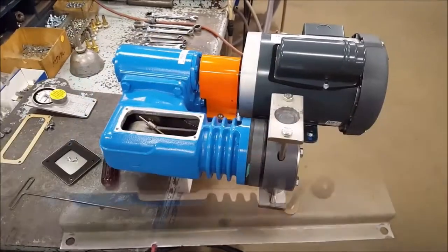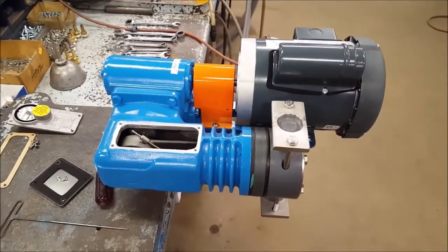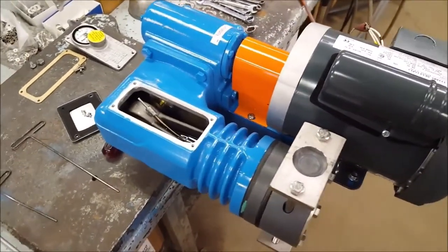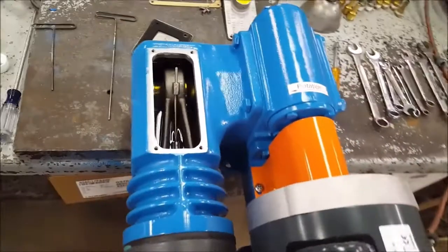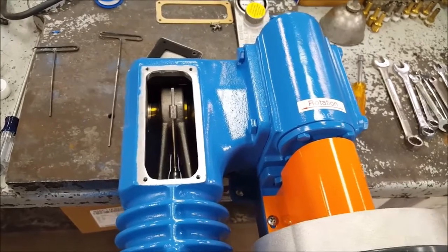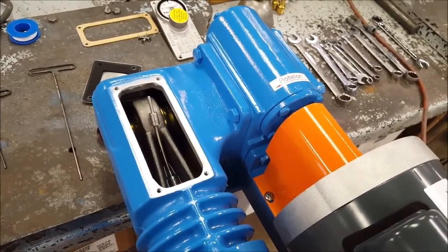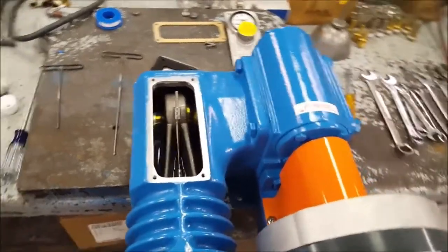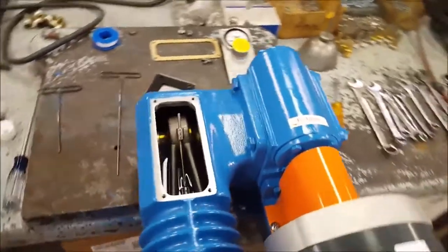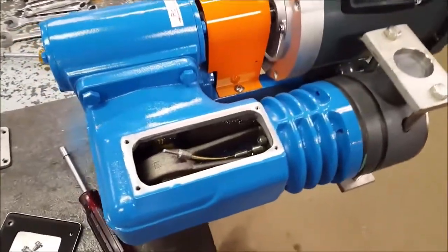And finally, here we have a pump in testing. This is a Madden MF110 pump, pumping at a maximum of 10 gallons per hour. This is why the rod and piston are moving slower than the cutaway MF118 pump we just saw. You can see here how the interior parts are submerged in oil, allowing it to be constantly lubricated. Madden pumps, with the proper exterior conditions, can continue operating efficiently like this for many years with only minor wetted end repairs.